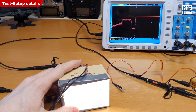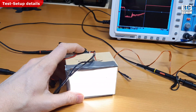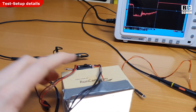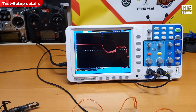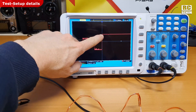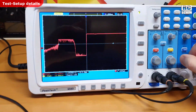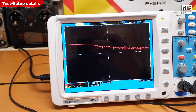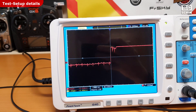Here's the basic idea of my oscilloscope measurements. I have a 12V LED. The 12V power is probed with one probe — that's the red channel. When you switch it on it goes from 0 to 12V, which is the step up. The good thing with an oscilloscope is you can zoom in very close and measure even micro or nanoseconds.